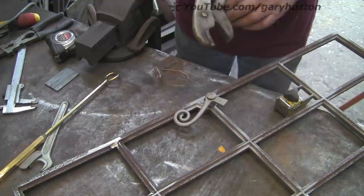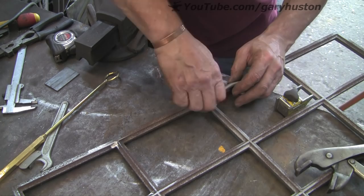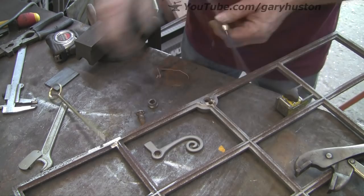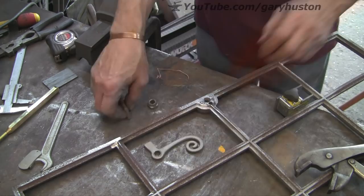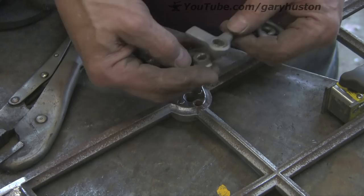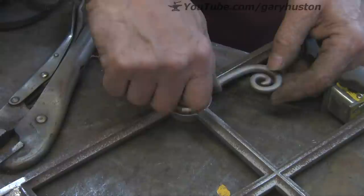These are just peened over at the back, so actually that one's pretty loose which I wasn't expecting, so I'm going to take that out. I'm hoping you can see there - there's something that's been done before. I think this is a second repair anyway - there's two rivets or something already there and the hole that it's been fixed to looks like an afterthought. So I think these handles have been put on afterwards. I'm hoping I can just use the original spacer and tighten that up a bit more, hoping I've got enough thread left.